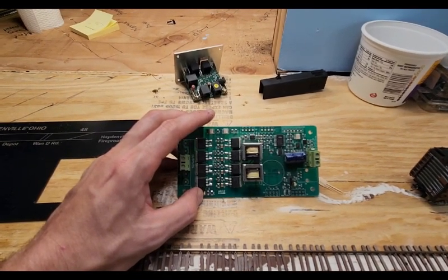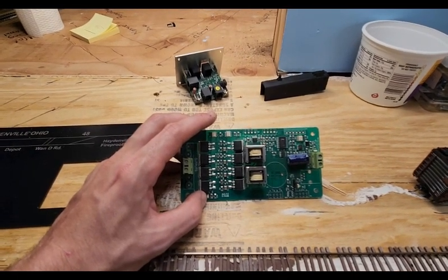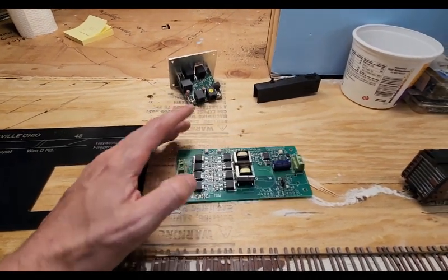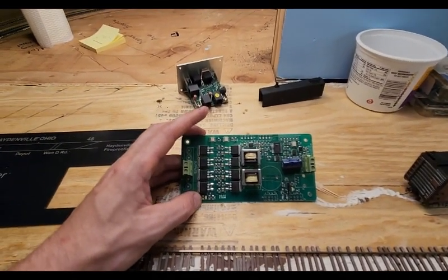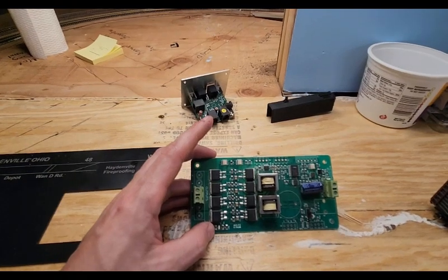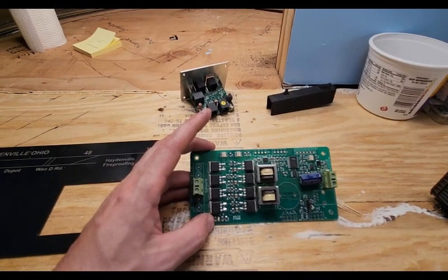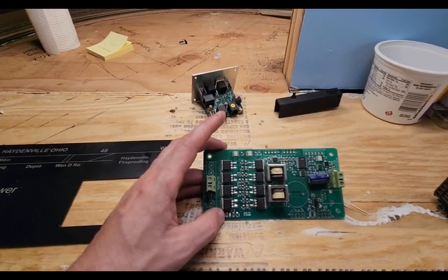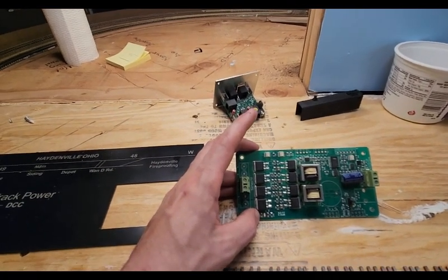The older boards that were relay based and not solid state would take the power surge, interpret it as an electrical short, and shut the power off. So the older Digitrax AR1s, a lot of the old circuit breakers will do that. These don't. Now, they have since come out with the PSX ARs, which are the same company, just a newer version, with some extra features, also about $20 more. Either one, I don't care the price, these things are worth it. I put 8 of these in at Nolan's, both the regular circuit breakers and a couple of the PSX ARs before they upgraded them and released the newer versions.